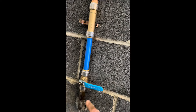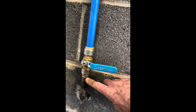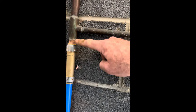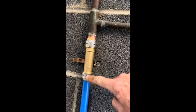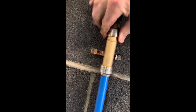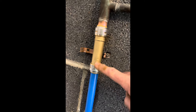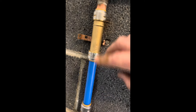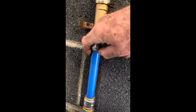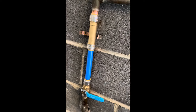Here's how I decided to do it. I put the valve directly onto the copper, then put this slip joint right here. I put it up into the copper up here, already had this piece of PEX slid up into here, put it in place, put the tool on here to give me some slack, and then dropped this down into the valve.